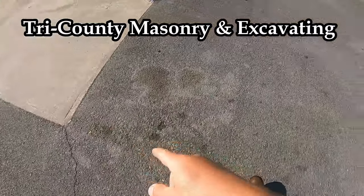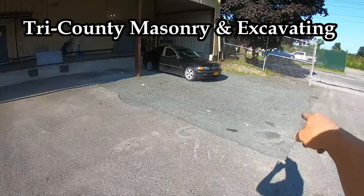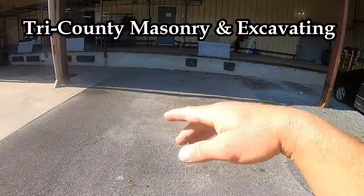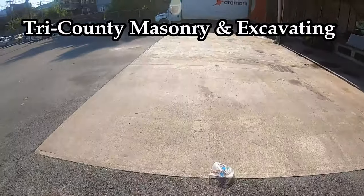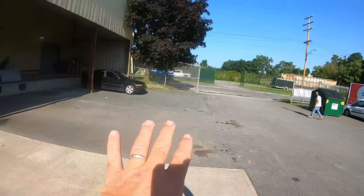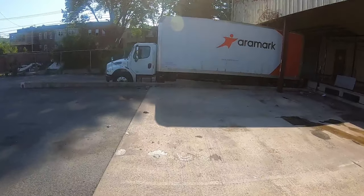So we're gonna saw cut this blacktop, pull all this blacktop up, take out the crusher run down to 6 inches and pour concrete back in 6 inches with a broom finish. Pretty straightforward, pretty simple. Just match this over there. That's phase one, and that could be done during the week.